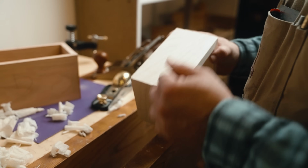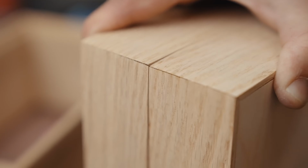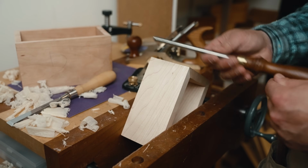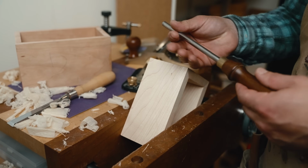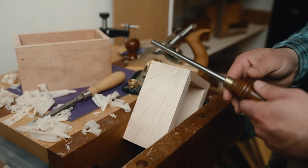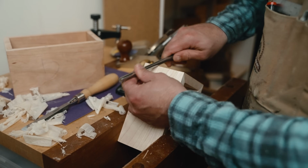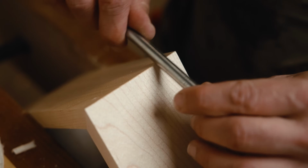Okay, now I'm gonna show you a clip here. I made this jewelry box and I had a gap in one of the trays. And a great way to fix this, you take anything round, because any steel is gonna be harder than wood. So like your screwdriver, take like this part of the handle of your chisel, especially if it's longer than that one, or a burnisher, and you're just gonna roll your edges over like this. And this is going to fix any gap to make it look really seamless.